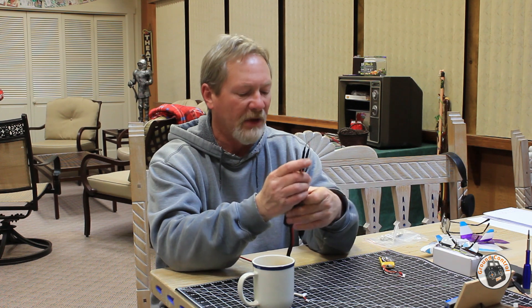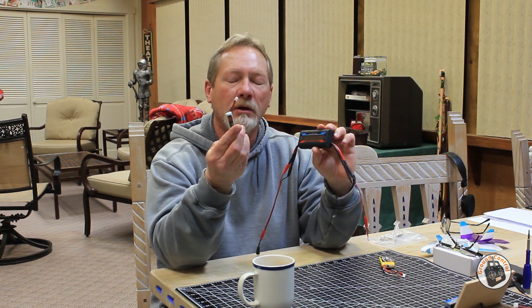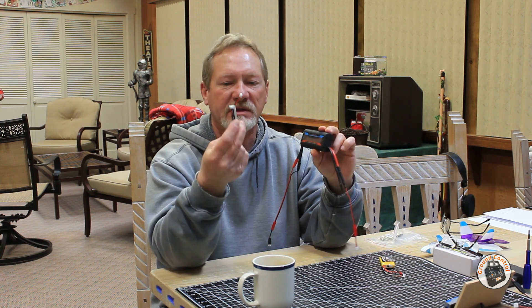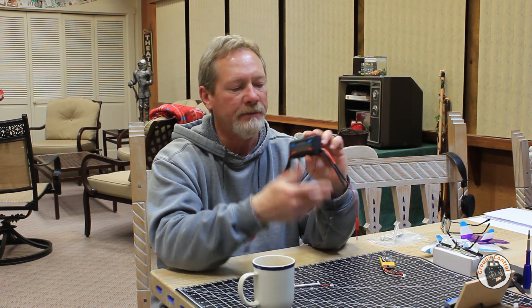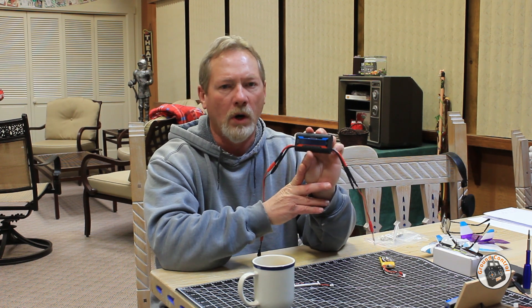Now there was one eccentricity I found. I put a multimeter on the source battery before connecting it, and the unit showed 4.05 volts DC. On the multimeter, the battery showed 4.25 volts — which is what I had previously charged it to. So the meter was showing 0.2 volts fewer than what the battery was actually supplying. I then put my multimeter on the load side to check how much voltage was going into the speed controller — it read 4.25 volts. So I don't know why the meter was only displaying 4.05 volts; it was registering 0.2 volts less than what was actually coming through from the battery.